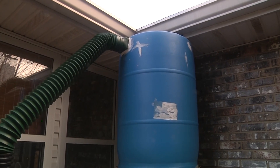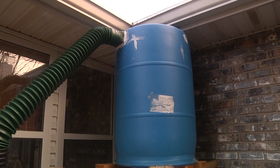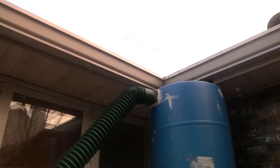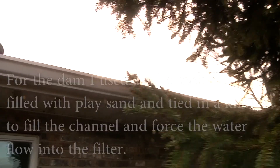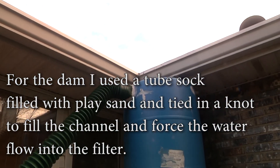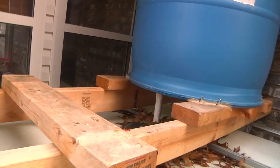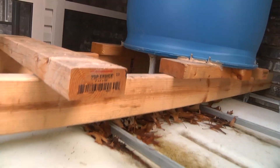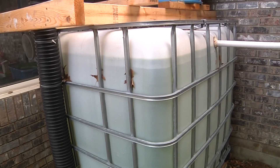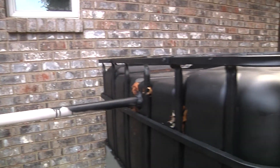What you can see here is we basically got a 55-gallon drum, and I built a filter out of it with sand and charcoal and rocks. It comes in through the roof here, the water comes down, and I've dammed up these gutters on both sides so the water comes rushing in through this filter. It filters through and goes into my 275-gallon tank that I bought off Craigslist for 50 bucks. This is filtered water that goes in there, and I've got an overflow from one tank to the next for more storage.